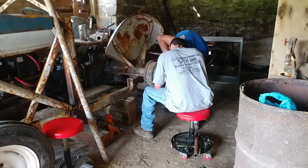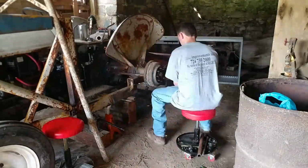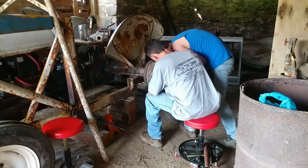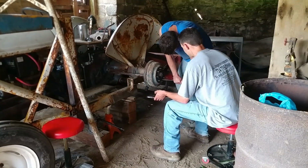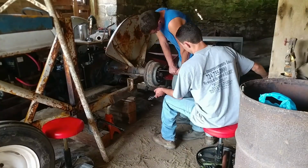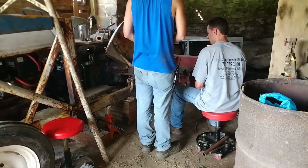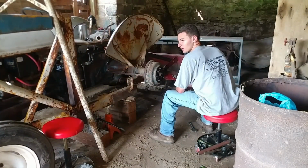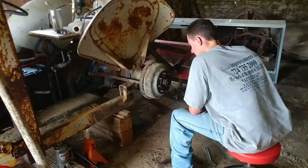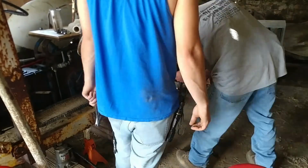And also there's this brake drum. I wish I would have moved the camera in closer. There are 4 flathead screws that you had to take out to remove the drum, and you also had to release the pressure of the shoes off the drum. After we removed the pressure from the shoes, we were able to get out 3 of the 4 screws on this brake drum.